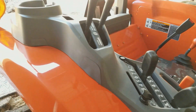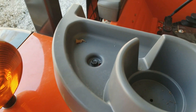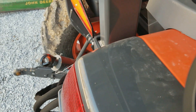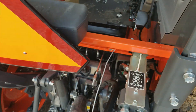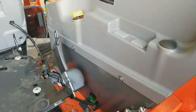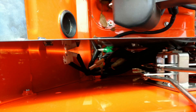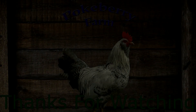To diagnose the relay issue, I took off the top gray piece, slid the plastic covers off the levers, pulled the bolt and side bolts, which allowed me to pop off the whole console. You have to be careful because the PTO is a wired switch. Inside you see a whole mess of wiring - you want to make sure everything is connected. There are two loose connections on this model because it doesn't have all the options installed.